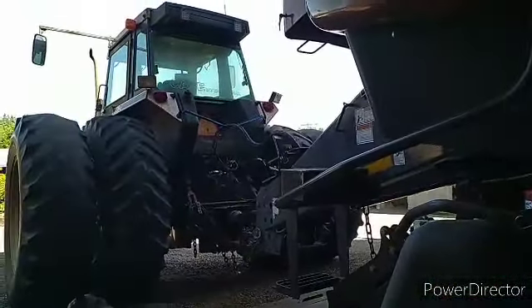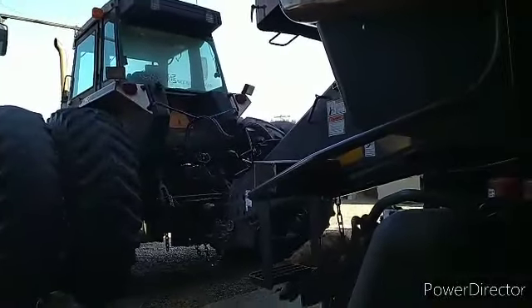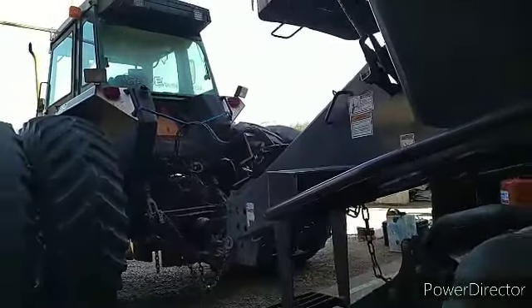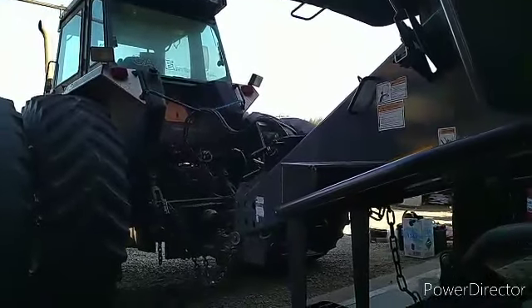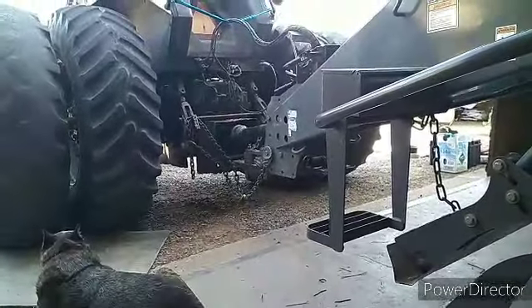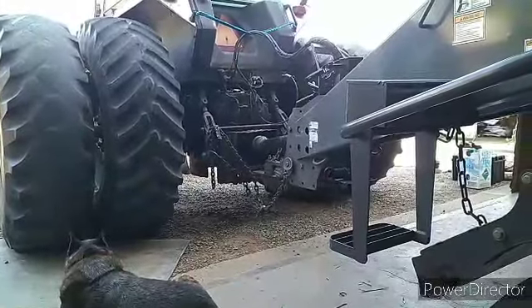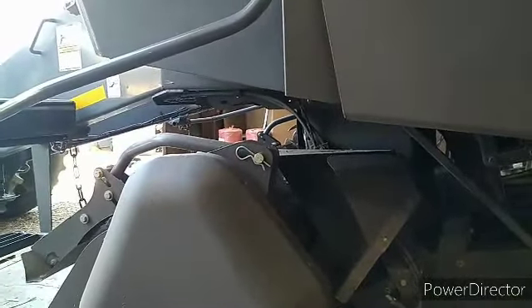Must be feeding time since the dogs just came out. Up there I braided some of that blue twine and crimped disc hooks on the end. Gonna leave the bungee cord on there. I totally forgot I was going to find a regular bolt-on clamp and put it on there — it's on there with two zip ties. Got the jack handle figured out and hung, got the support chain tightened up, moved the hook one link and it seems to be just about right. I can't find anything else to do on this thing other than oil the chains. We're gonna oil the pickup chain before we start, but the knotter chain and the stuffer drive on the other side — I think we're gonna run it part of a day first, get some of the rust busted off, and then we'll oil it.